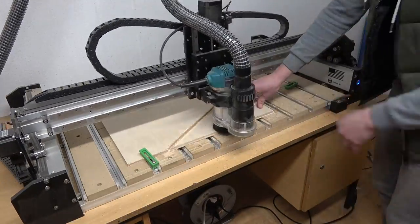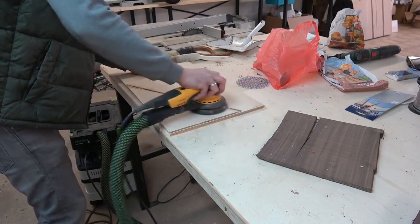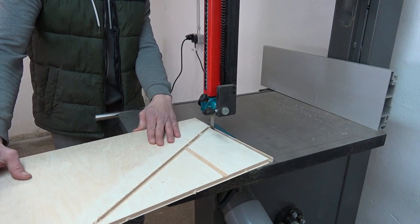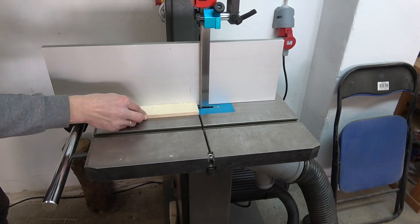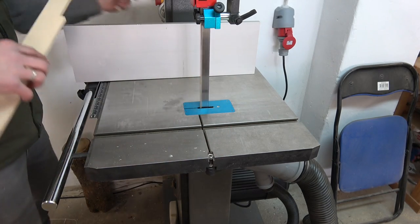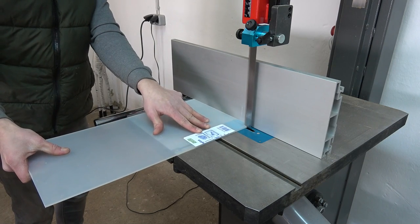For the board we need a bunch of 30-degree angled pieces. Since I do not trust integrated angle measurements at all, I went for a variation of a so-called Fritz and Franz jig with a 30-degree slope. CNCing some plywood made quick work of accurately getting the angle done, and now I just needed to install a piece of acrylic which was used to make it slide accurately and parallel to my saw blade.